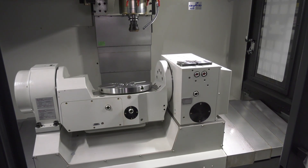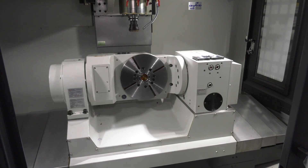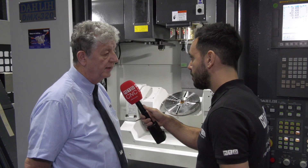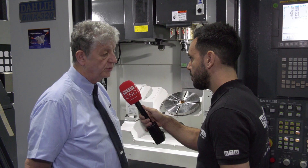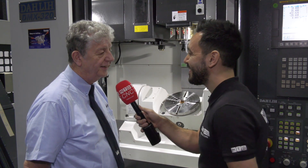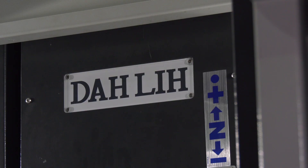It would accommodate most size components — the average amount? That's right — this table is a 320mm diameter table, it will swing 350mm, and we can take some large component weights. One of our particular customers wanted to do a part which was 500mm long, which tested the capacity of the machine, but we managed to cut the part and the machine is now sitting nicely in his factory.